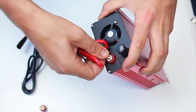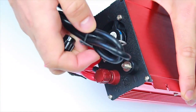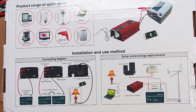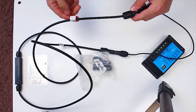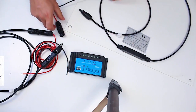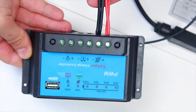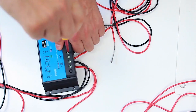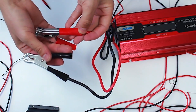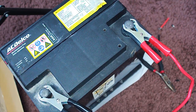When putting together systems like this, manufacturers recommend using specialized wiring for better isolation. The connection process is very simple. First, connect the solar panel to the controller, plus to plus and minus to minus — on the controller you will see an icon indicating where to connect the panel. If you have more than one panel, just plug them in parallel. Next, connect the battery to the controller, and the last step is connecting the inverter to the battery. Be very careful with the polarities, because if you mess them up the controller may malfunction and break.